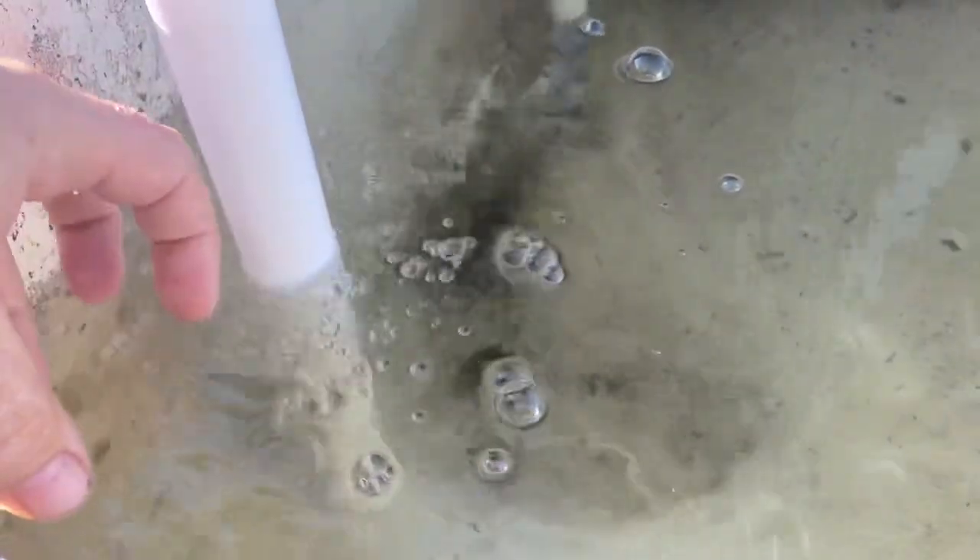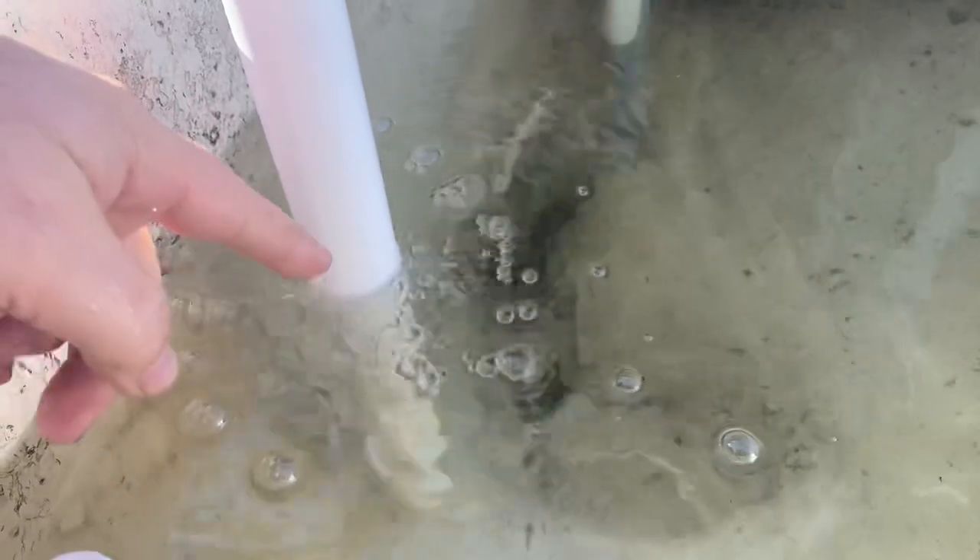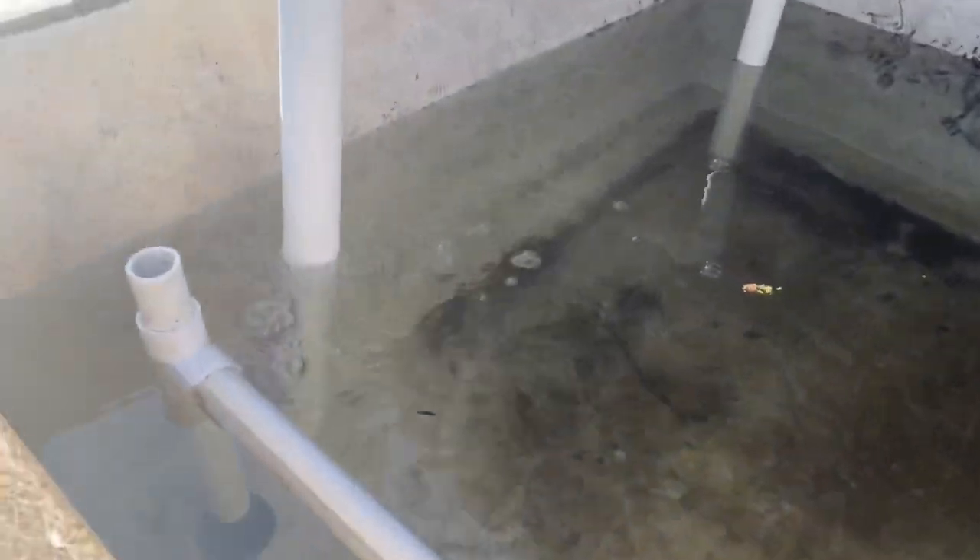What happens is it drives the water into the column. The air actually compresses inside the pipe - some of it does rise through the water column and come out the top of the pipe, but some of it's forced through the holes or slits, depending on how I design them. And we end up with this beautiful aeration.